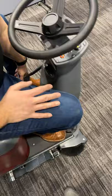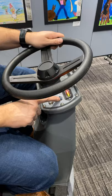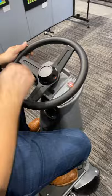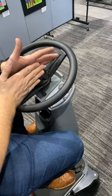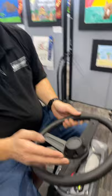You ride that side right on the wall and get that offset cleaning. When you're done cleaning, raise up your lever over here, then turn the vacuum switch off. The only other switch on this machine slows the speed down a bit — it has a picture of a turtle. The steering wheel is offset to give three points of contact for steering regulation, so you can see the panel as you're driving. Everybody wants the steering wheel centered, but it is offset so you can see the panel.